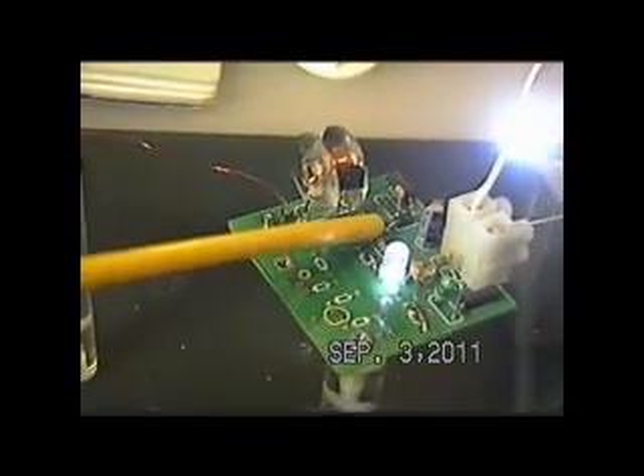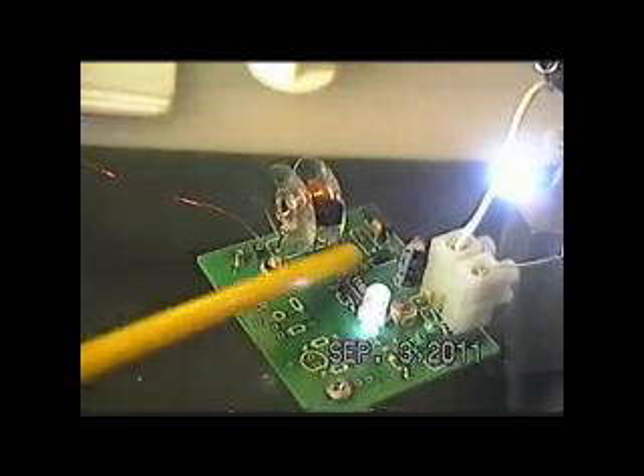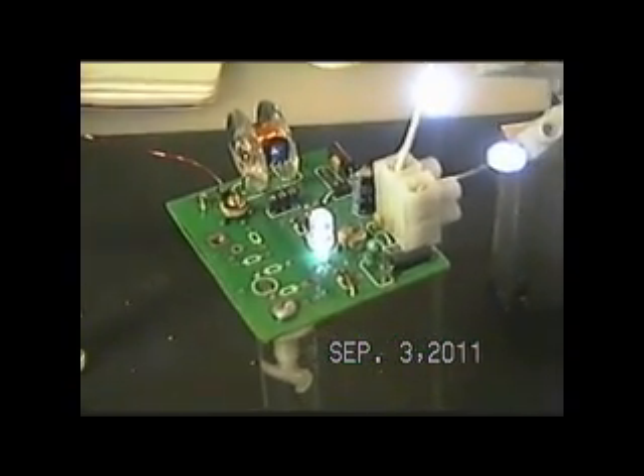In the board that I was using earlier, I have a 1N4148 over here for the protection diode, where the normal 18s will come with a 1N4001 or a 1N4007 there. But other than that, this is really an 18.